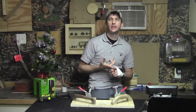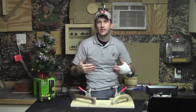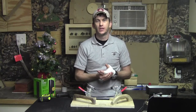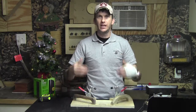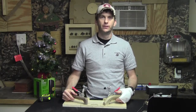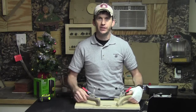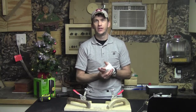Another user recommended that maybe you set your fence back all the way for that fourth and final distance cut and use one inch sacrificial fences. If you can find some material that is about one inch thick, or maybe mill a couple of boards down to one inch, you can use those as sacrificial fences — put all three of them up to make your first cut, remove one, make your second cut, remove one, make your third cut and so on. That's actually a really good idea.